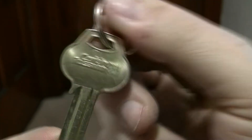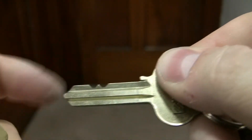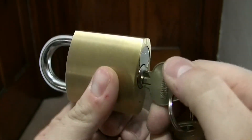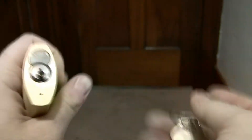There's an authentic Corbin Russwin key — uncut, which means this lock is zero-bitted; it has top pins only, no bottom pins because the key isn't cut. Here's your other Corbin Russwin key, just cut in a couple of spots for the control key. See how easily that slides in and out — locks open, works just like a Best does. But a Best core wouldn't fit in this lock because it's not set up the same way.